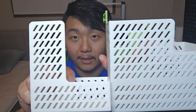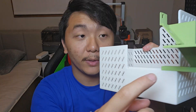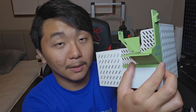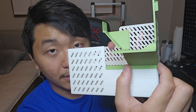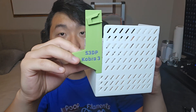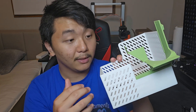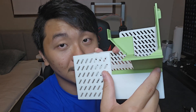You can see the different wall behind there — this one is significantly better. And based on my opinion, the most important improvement of this design is right here: the dovetail joint. I actually doubled the size of it. Version 1's connection only came up to here, but when I printed the big bin, I noticed that when filaments fill up, it kind of flexes. I think if there's too much filament, there's a chance it might break. So I doubled the size of the joint to make it more secure.